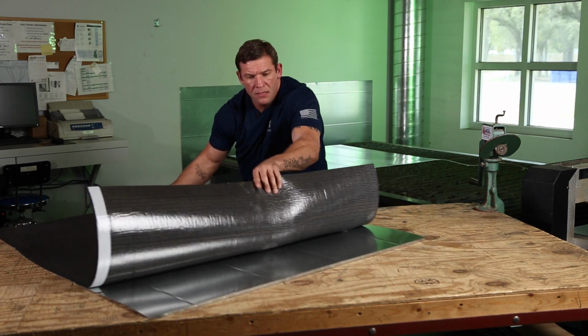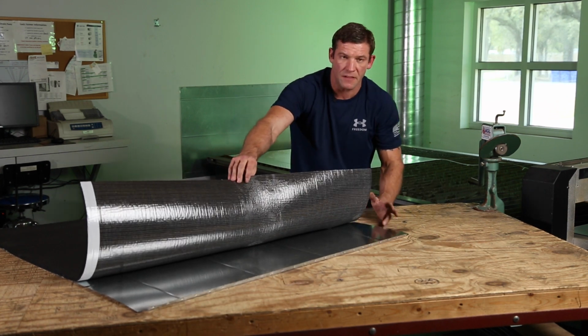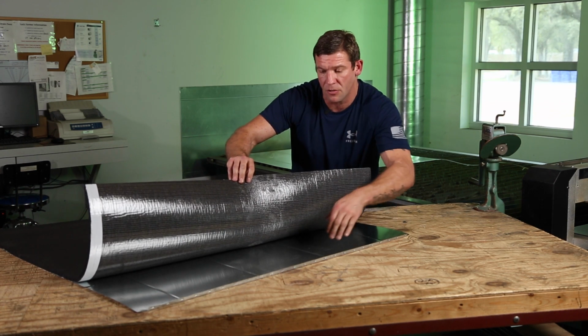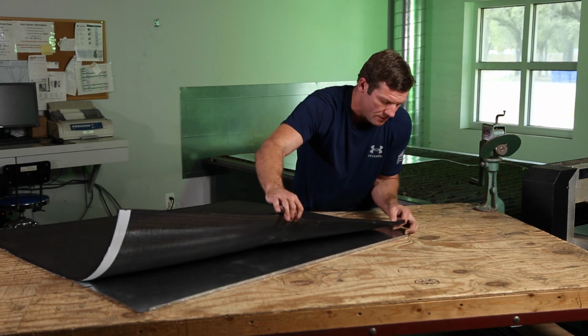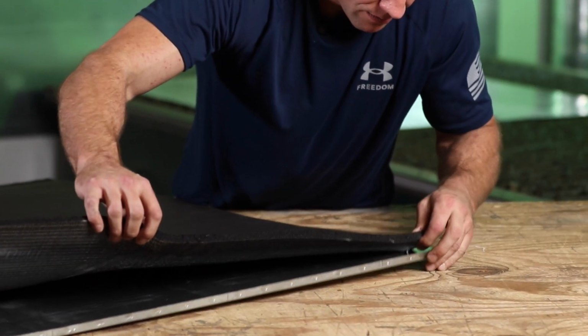And now when I get to my last 10 or so inches, this is where the pro side of this comes in. And it's because this material is flexible, it will flex. So you need to make sure it lines into this. So if it's long, you need to tuck it under. If it's short, you need to stretch your material a little bit. So I'm gonna come up this corner, and I'm actually short. So I'm pulling right here.